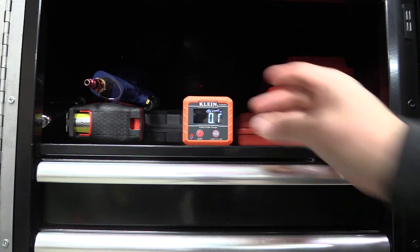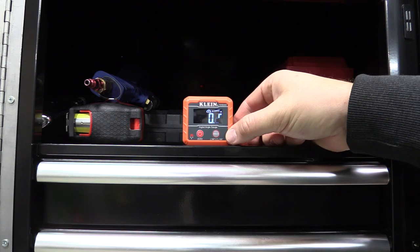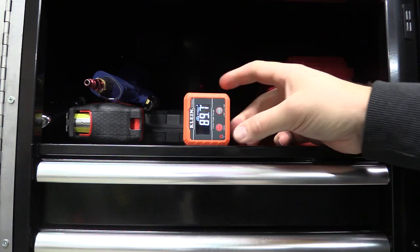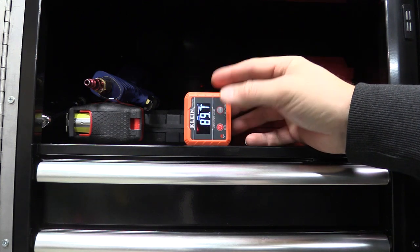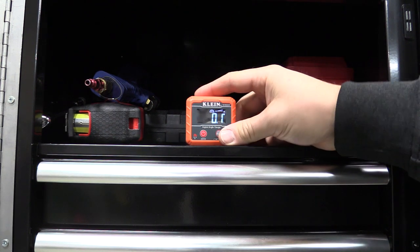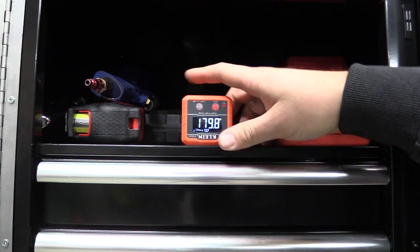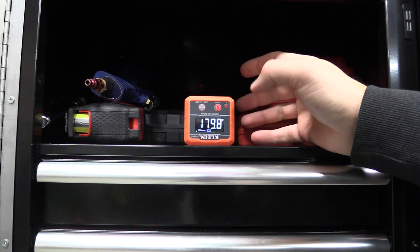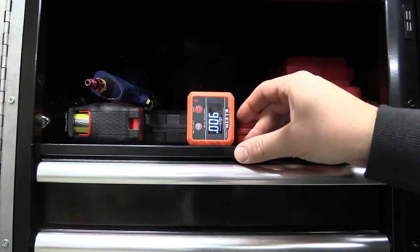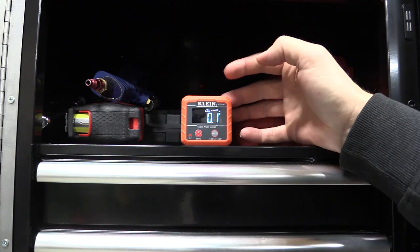If we move it, it will change — this metal surface is not perfect. I want to test it by cruising over to 90 degrees. Technically, if we're a tenth of a degree off, that should read 89.9. Flipping it over, we're about a tenth of a degree off — and there we go, perfect. Other side is also about a tenth of a degree out, so it's not absolutely perfect but it's very, very close.